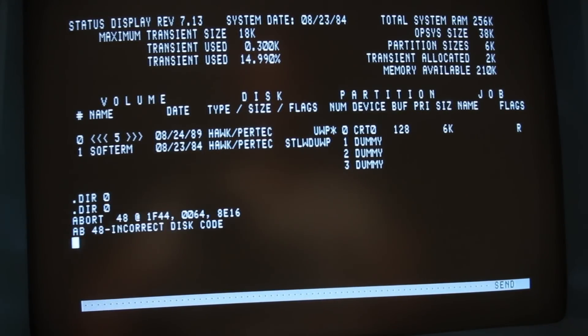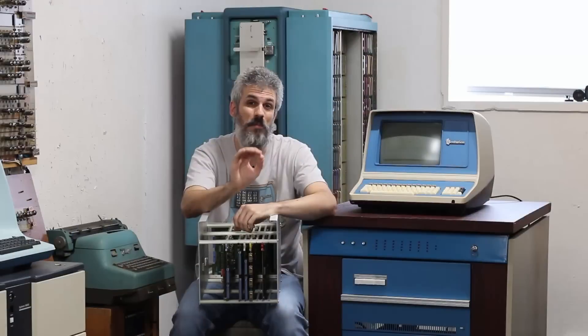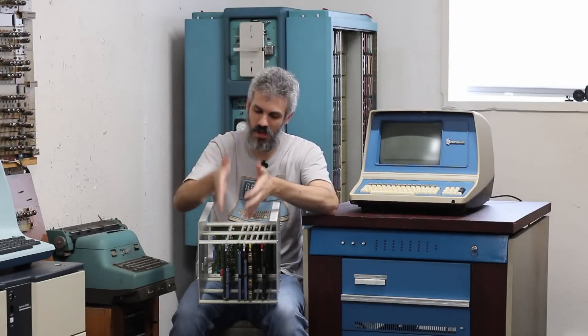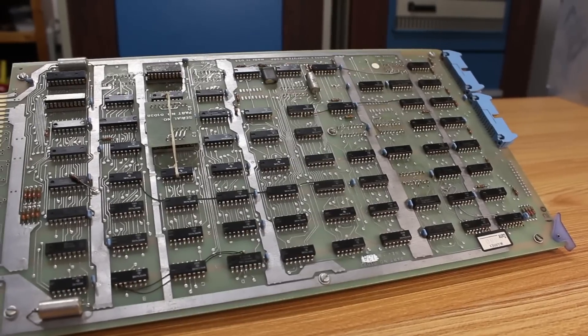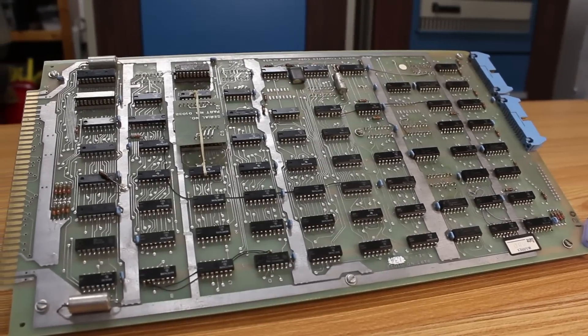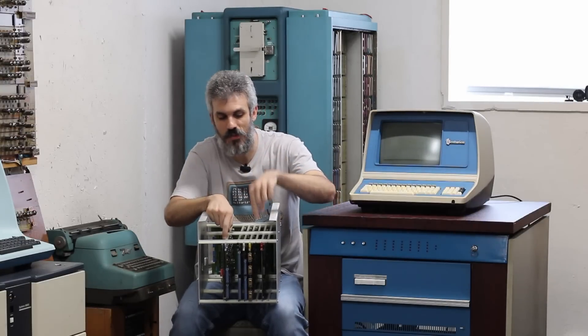We're in an interesting spot because I have two CPU 6 systems here, but Butler Tech has a CPU 5 system, and I can't provide software support for a CPU 5 because the two are pretty dramatically different. They share a core instruction set architecture, but the CPU 6 is so much more expanded that anything written for the CPU 6 can't run on a CPU 5. Also, any applications written for the CPU 5 can't run on the CPU 6 unless they're recompiled. Talking with Mr. Hall, we came up with a game plan.